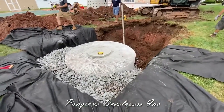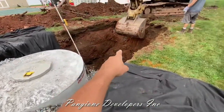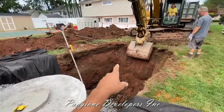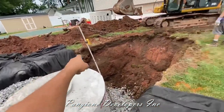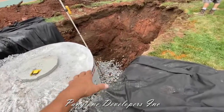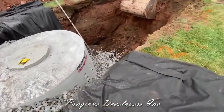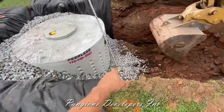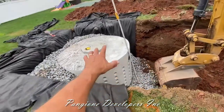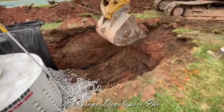Here's the first pit — we have it backfilled with about a foot and a half of stone. Now we're going to excavate this area right here and put the second 1,000-gallon pit right in there. We put more filter fabric, put the base of stone, and set the tank right on top. You can see we have about a foot of shoulder stone below — we sit the tank on top, level it all off, and that's how we install the seepage base.